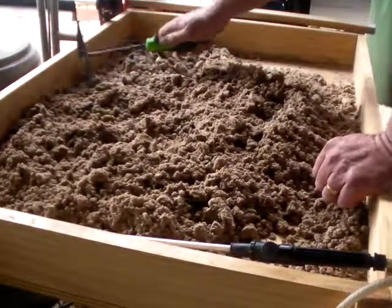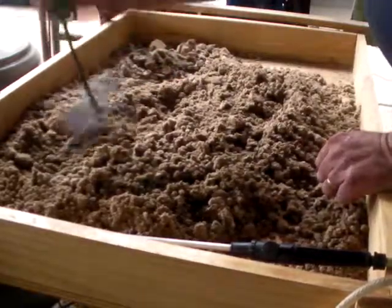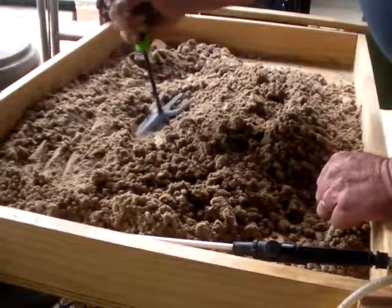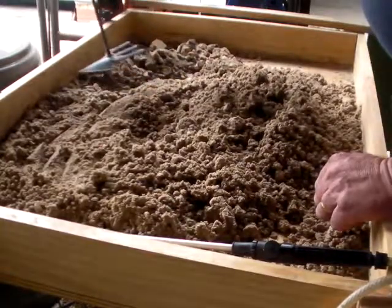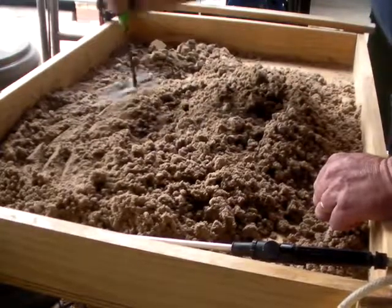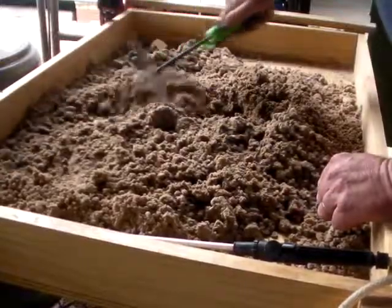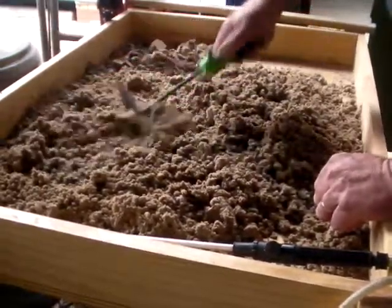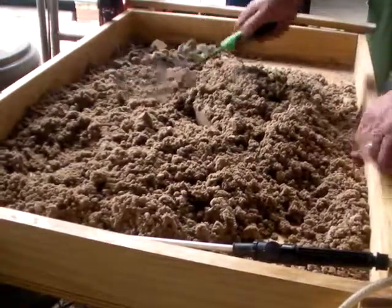It takes a fair amount of work to create the moulding sand in the first place. The sand is difficult to make, but the bentonite clay starts life off for me as a bag of kitty litter. I crush that kitty litter up into a fine dust so I can successfully mix it in with the sand. I shall continue on — thanks for watching.